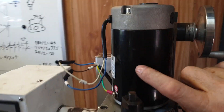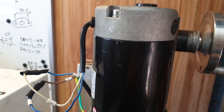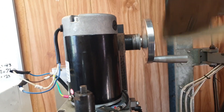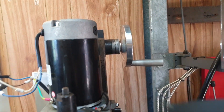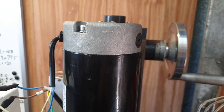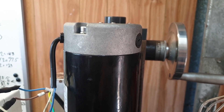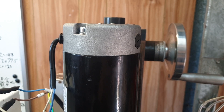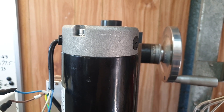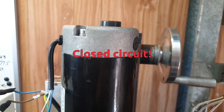I just lifted this off — it's just a magnet case — and the commutator was black. I tried with some isopropyl alcohol but it didn't clean it, so I got some 240 grit sandpaper and went around the commutator. I got my multimeter and tested between the points on the commutator, and when I started it was short circuit. When I cleaned it up and blew it out with the air hose, I got rid of the carbon off the commutator between them with compressed air.